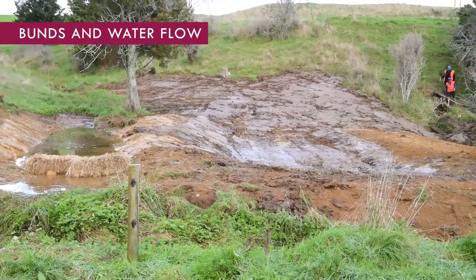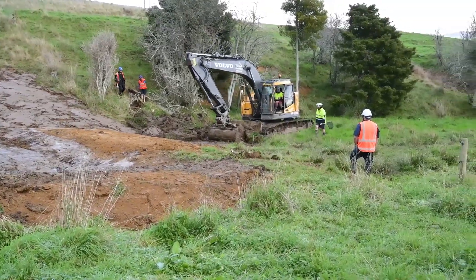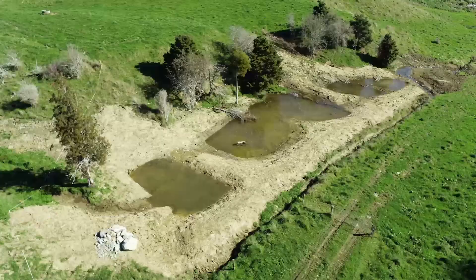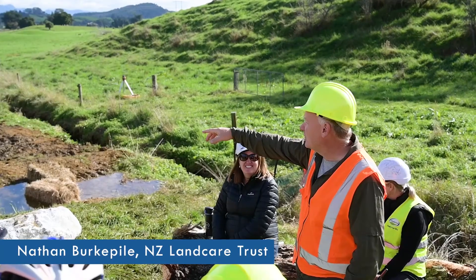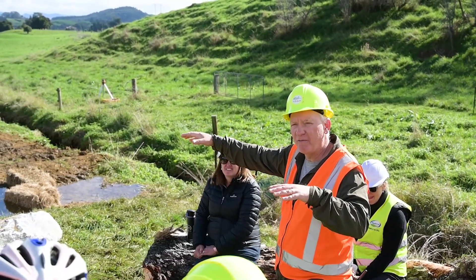They're digging deeper than I'd normally go that close to a created berm because of water flowing over that berm and causing erosion, but we're going to put a spillway in there. We're rocking it really hard, so we created a deep hole at the bottom to spread that water out and slow the velocity down so it goes through the rest of the wetlands. Because we went down here, we won't have to put as high a berm down below — there's that trade-off.